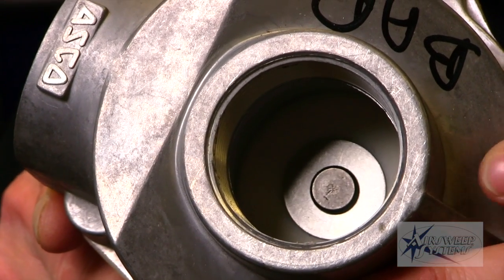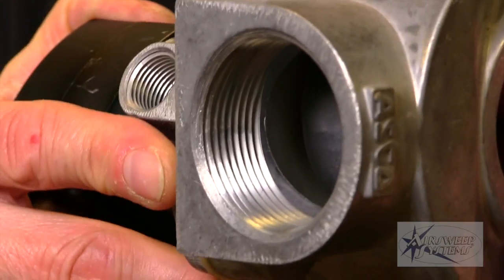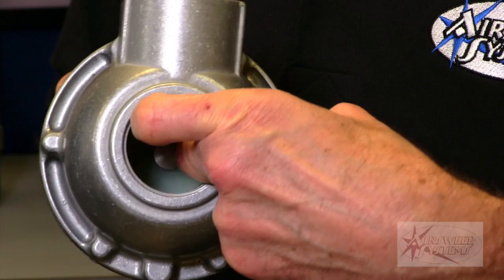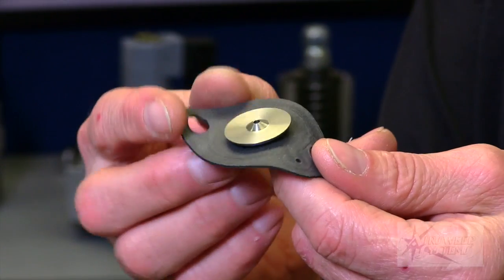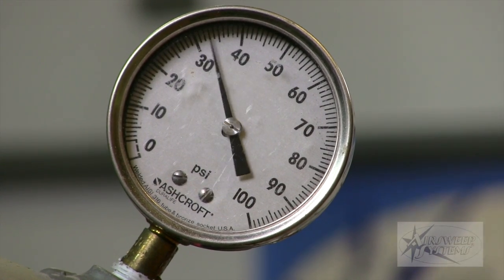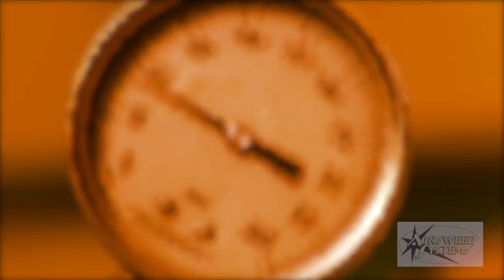This inch-and-a-half diaphragm valve has an upper and lower diaphragm, both of which flex with each pulse. After a large number of flexes, the diaphragms may stiffen and no longer reseat properly, causing leaks, performance issues, and even equipment failure. A small leak may initially just be a nuisance, but could grow into a much larger problem if not addressed early on.